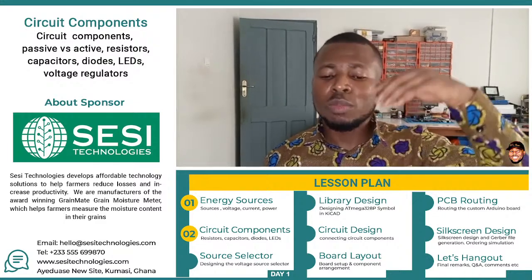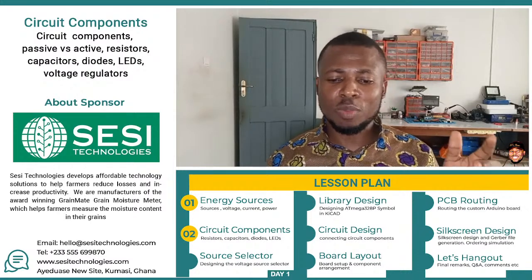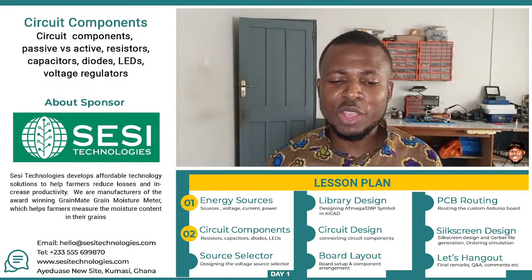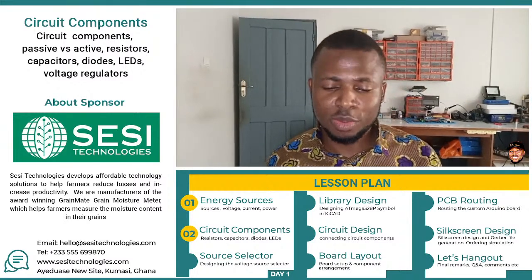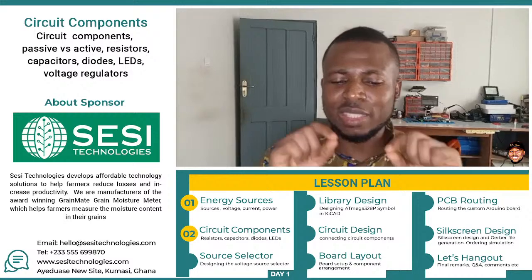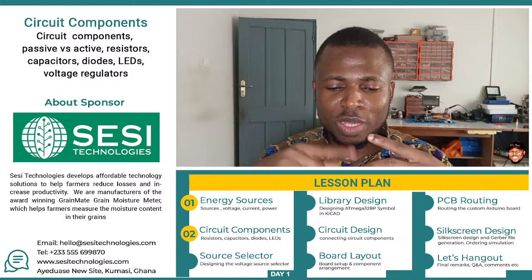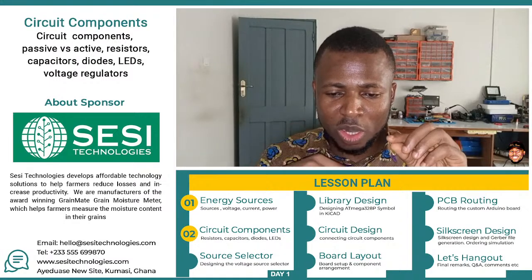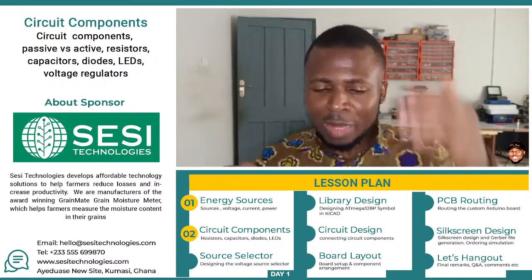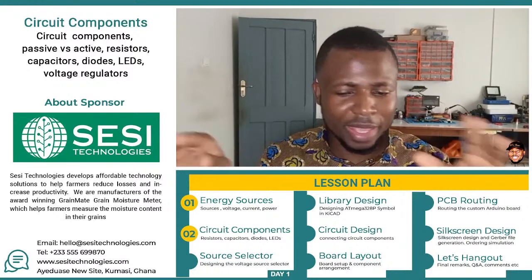The configurations usually differ. We have something called common anode or common cathode, okay? So right now I can't tell you to connect this to that. It will depend on whether your LED is a common anode or common cathode, okay? So just probably check it out. I think usually you can identify that by the length. If you take a physical LED, the anode terminal is always longer than the cathode. Okay, so what I have observed about the common anode, the pin lengths are not the same. So probably just look at how yours looks and check it up on Google.